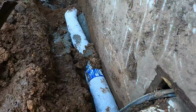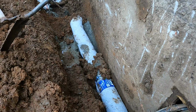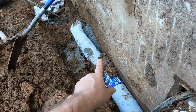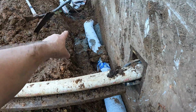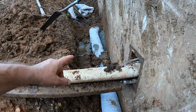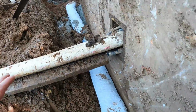Okay, so I poured some concrete around that, cleaned it up best I could, and got down deep, filled that full of concrete, sloped that from the bottom of that opening to here. I sloped it in the clay, laid that drainage pipe on top of that and right on through here. I'm going to go right on around the house with it right now and come back.